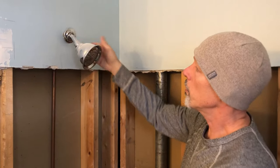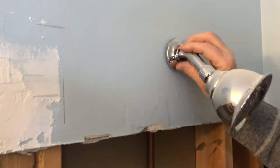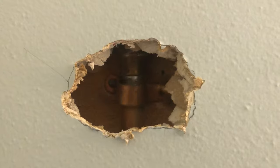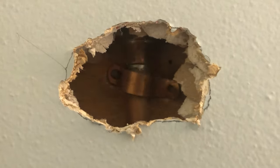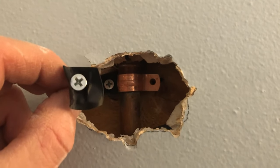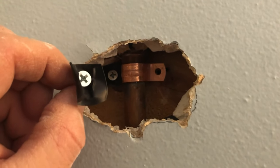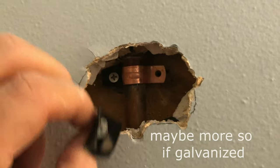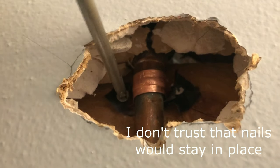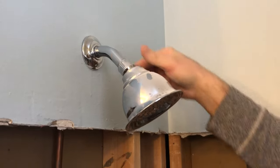See how all this jiggles — so every time we take a shower, this would always drive me nuts. It would come off basically and move around. I'm going to jiggle the shower head — oh my word! You can see those nails and the strap and all the noise that would vibrate from them. To fix these fasteners, I'm using little metal screws and I put some doubled-up electrical tape there just to cut some of the vibration. It's questionable whether or not you can put metal on the copper, but I think this is fine. I'm shaking the shower head and that really tightened it up — we're really going to make this place quieter, I hope.